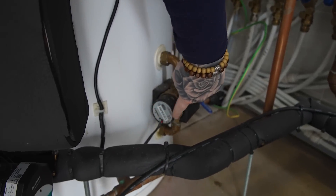If somebody needed more hot water, we would utilise what we call a top-up pump — sucking water from the lowest part of the tank, through the pump, up through an internal pipe into a diffuser. What we then do is atomise: we spray the cold water sucked from the bottom of the tank into the already-hot body of water at the top. We spray it because it attains the same surrounding temperature instantaneously as the hot water. If we were to pour the cold water in, it would just dilute it. By controlling that thermocline, having the sensor array, and utilising the top-up pump and diffuser to atomise that water, we're able to push that thermocline down to increase the volume of hot water to whatever people require.